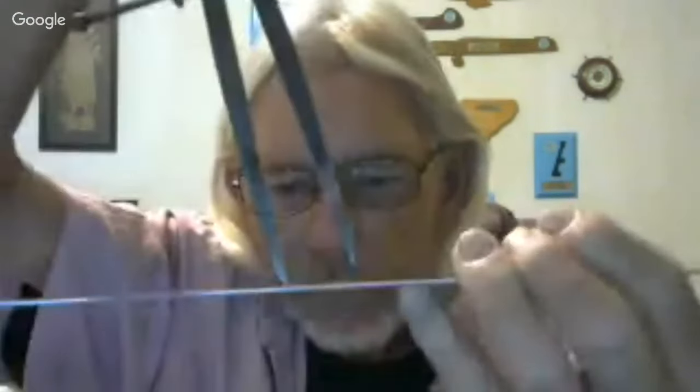What I was talking about, the indented numbers that are scribed into the ruler. If you've got the divider type caliper, you stick the points into each measurement, a 16th of an inch or a millimeter, and you can lock it in there and then get an accurate measurement between two different marks on the ruler. Yeah, just things to make life easier.